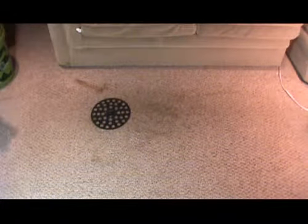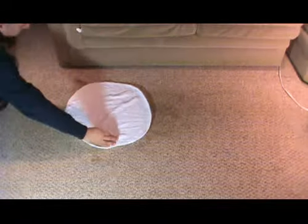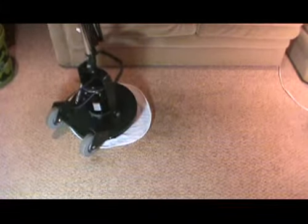Dirt and cleaning solution is removed with high quality cotton pads. The pads are wet with plain water. A plastic disc is placed between the pad and the rug. By using different sized discs, we control the amount of friction between the pad and the rug. We can vary it from the most gentle agitation to a good hard scrubbing. Our machine vibrates the pad into the rug in a circular orbital motion, which is better for cleaning than a simple spinning motion.